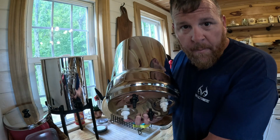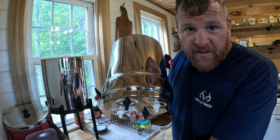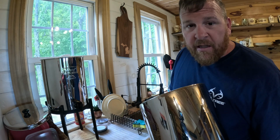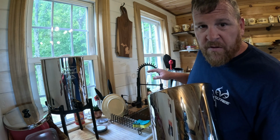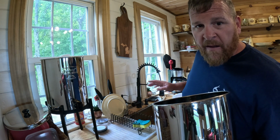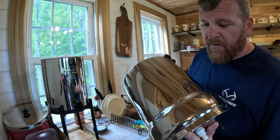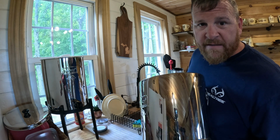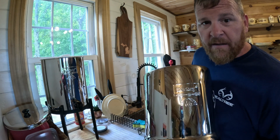So guys, the black filters from Berkey capture and eliminate 99.999%, I believe, of bacteria and viruses. So you could use water directly from an outside source, river, lake, directly rainwater. We use our faucet water, which is rain collection, but it is filtered through a sediment filter and a 1 micron filter prior to going in the Berkey. The 1 micron filter for the cabin is a simple setup, but it does not eliminate viruses and all bacteria. So we want to make sure that our drinking water is done with this here Berkey. And again, been using this for around 5 years, and we have not gotten sick or died yet. So we trust Berkey for our drinking water needs and cooking water needs, and it's worked really well for us.